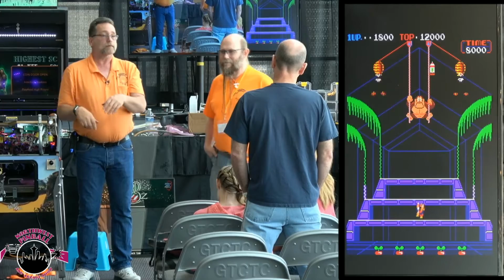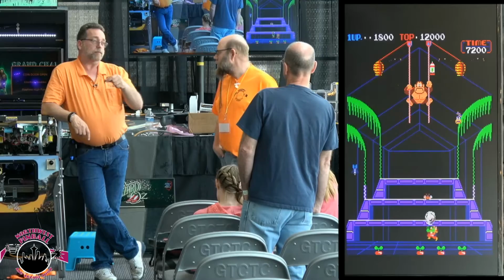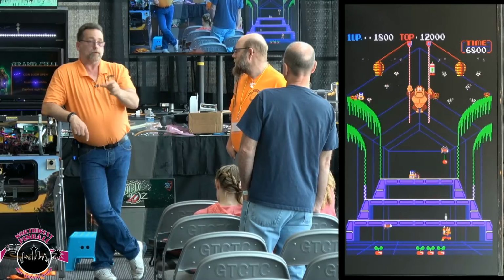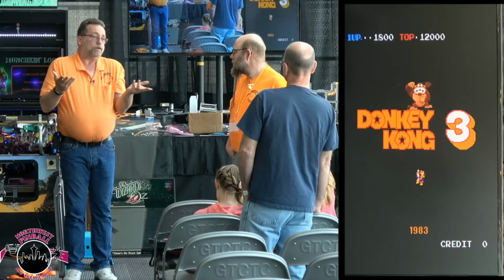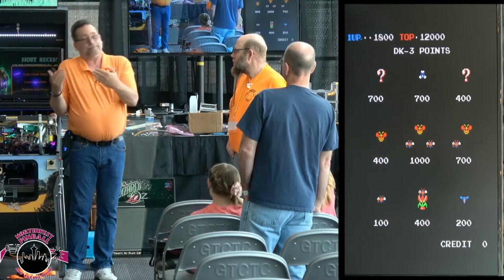It is. Whereas in both the 808 and the FR300, they have a metal cross plate in the back of the chamber, and it all just gathers up on that cross plate, and then you pull the chamber out, and worst case scenario is you take the chamber apart and all your solder's out. So that part was much easier, but the one from Circuit Specialist is at half the cost of the FR300 and twice the suction. And you've had to fix the FR300 a half a dozen times so far?